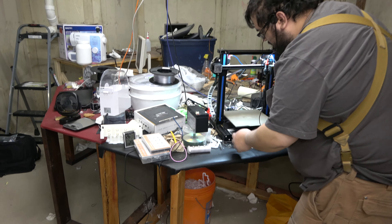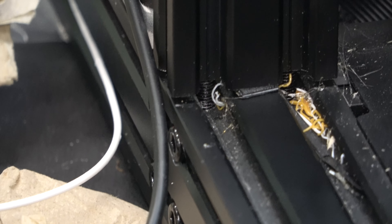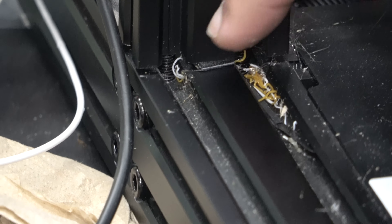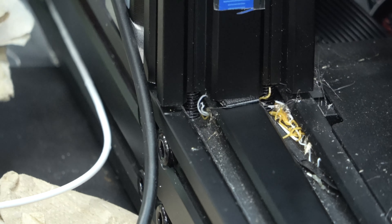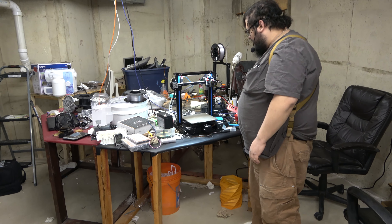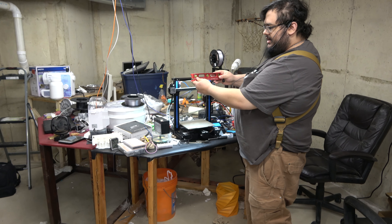If you come over here, you can actually see what we did. This is temporary, just to test out this thesis. You'll see that there is now a gap between where this horizontal and vertical extrusion intersect. This is what has allowed us to fix what Creality messed up in the first place. By raising this up, we take that skewed portion and balance it out.